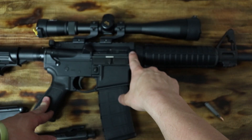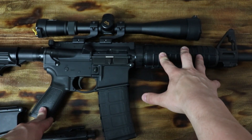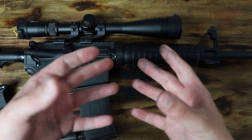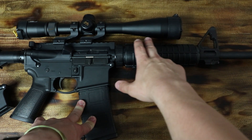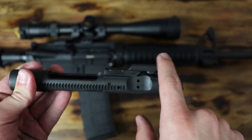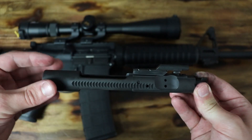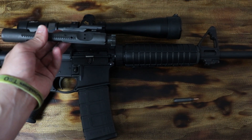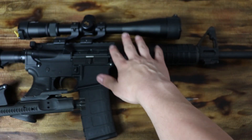What happens next? As your bullet is traveling through the barrel, hot gases are expanding in the back of your gun, creating a lot of pressure on the inside of your barrel. As the bullet travels through the barrel, it reaches the gas block. The gas block redirects the gases produced from this expanding bullet and shoves them back through your rifle, through the gas tube, into your bolt carrier group — into this gas system right here — which basically repeats the process of charging the rifle. It blows the bolt carrier group back and then sends it forward once more, resetting your hammer and loading another bullet into the chamber, ready to be fired.